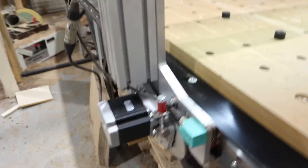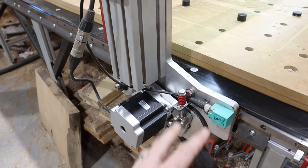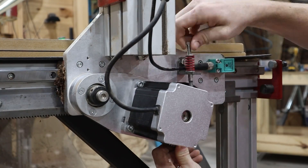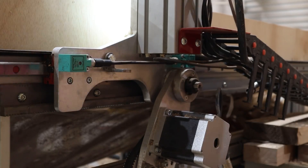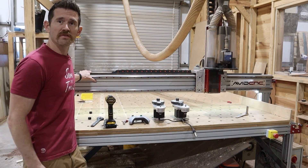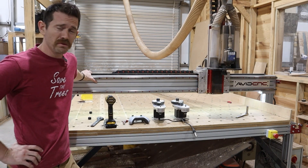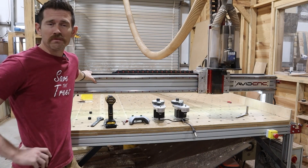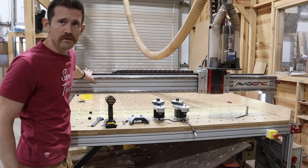One of the things that you have to do is disassemble the entire drive mechanism. I have to disconnect the motor, take the motor bracket itself off and everything — that whole thing has to come off so I can get to where the bearings are. Now that the drive motors are off on either side, the whole gantry system is completely free and I can slide it by hand back and forth. I don't really know what bad bearings sound like or feel like, but these don't feel that rough and they don't feel like they're skipping at all.